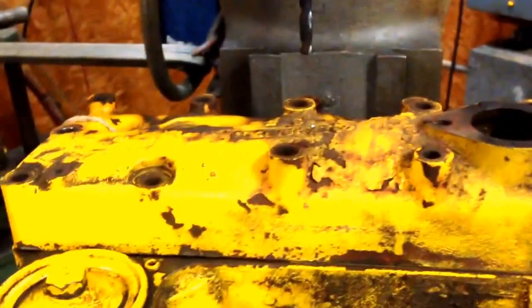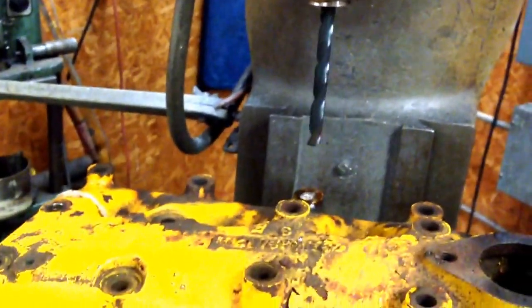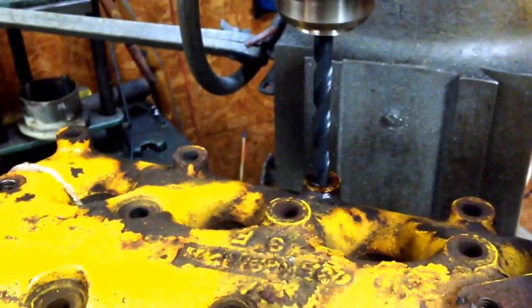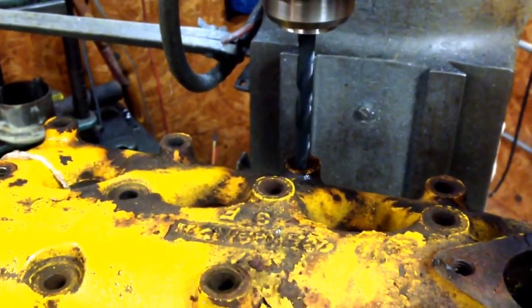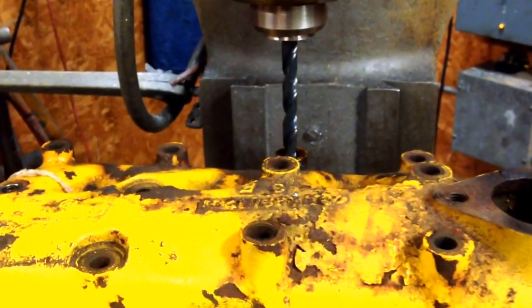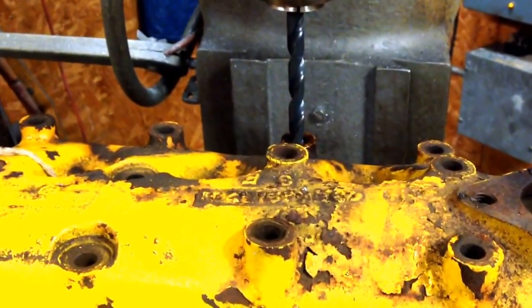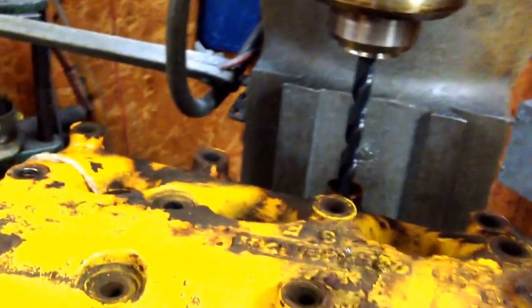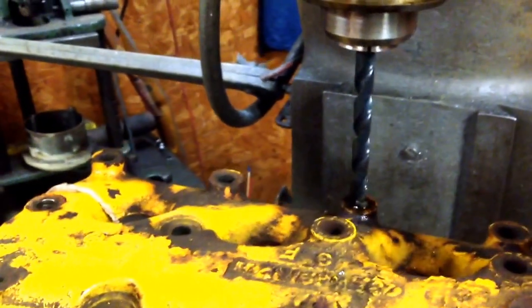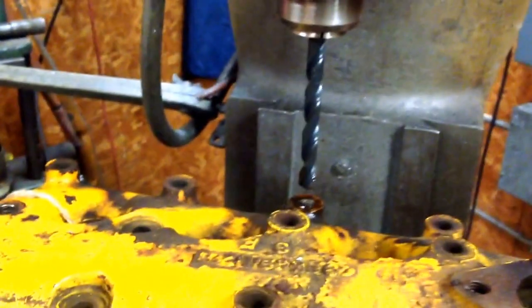We're located, got the Gibbs locked down. Going to nail this back one here. I'm in back gear on this mill so I can go real slow — and that's why if it bites in it ain't going to tear anything up.